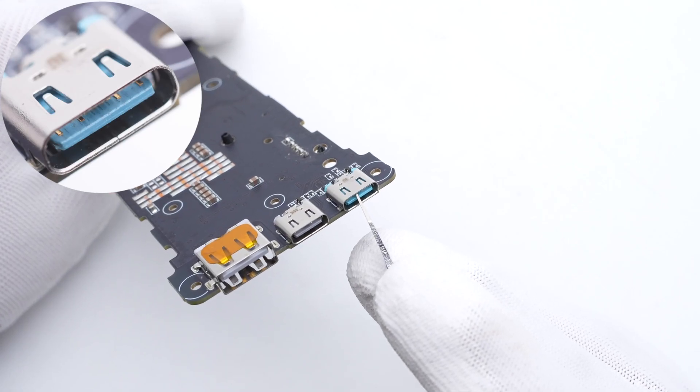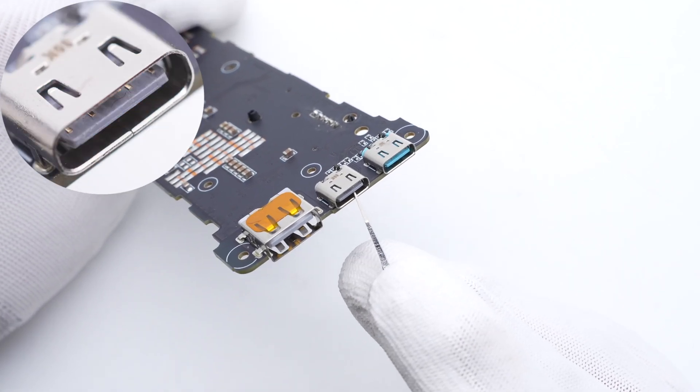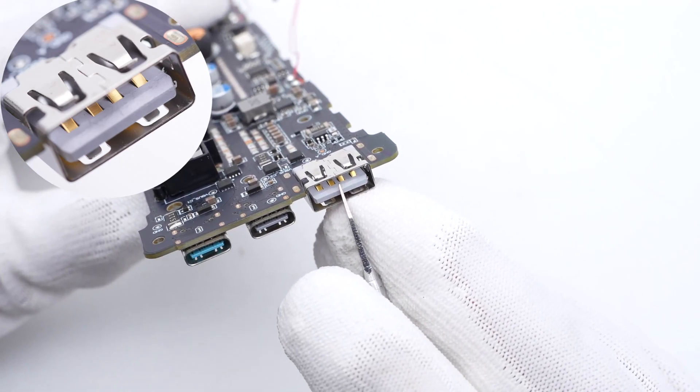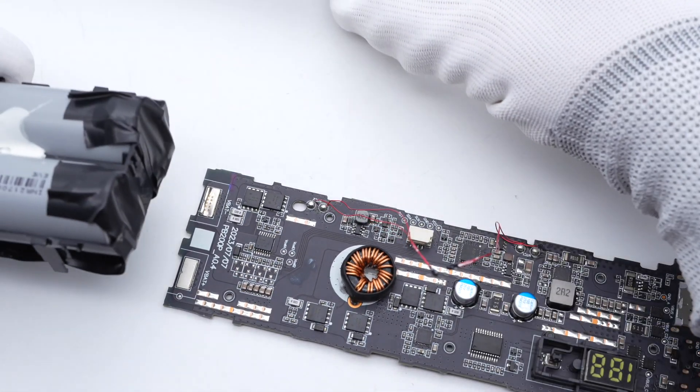The segment LED display and power button are reinforced with a plastic frame. The LED driver IC is from Titan Micro, supporting 16×8 LEDs with adjustable brightness via duty cycle. A small chip powering the MCU is marked HME-OD, with a 4.7µH inductor next to it. Another chip is marked LUFAA, and the voltage regulator is marked L4JNK. The color of USB-C1 is different from USB-C2 so you can distinguish them more intuitively. The USB-A connector is mounted in a hollow of the PCB to reduce thickness.